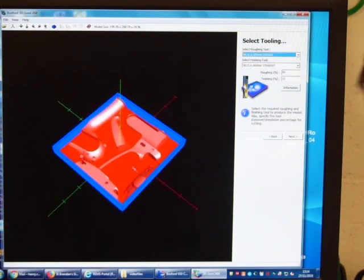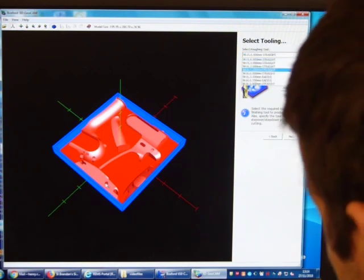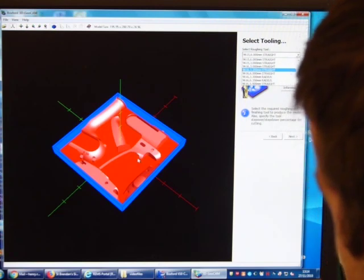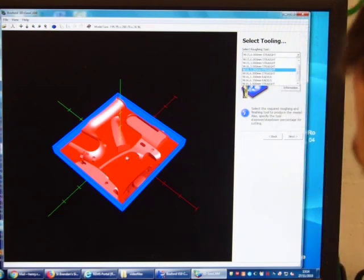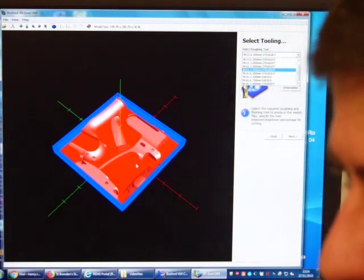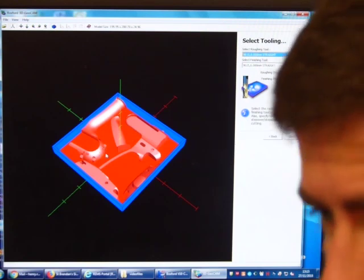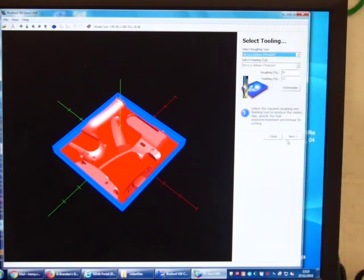I'm going to go for the straight cutter because this will mean these little bits here will be much more crisp, sharp edges. These internal edge corners are just going to come out nice and sharp, unlike if you use the radius cutter, you'll have a fillet around the whole thing. The flip side of that is I might just find the surfaces aren't quite as smooth as they would be if I used the radius cutter. So it's whichever way you prefer.